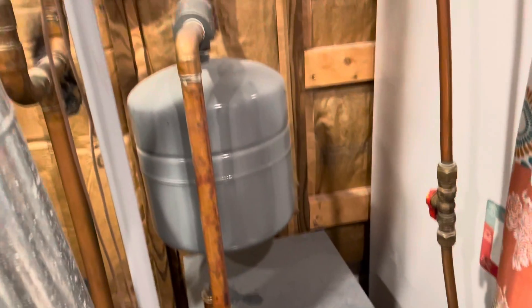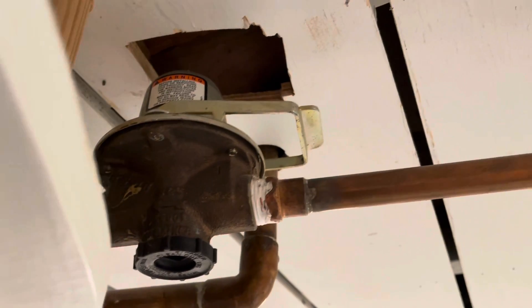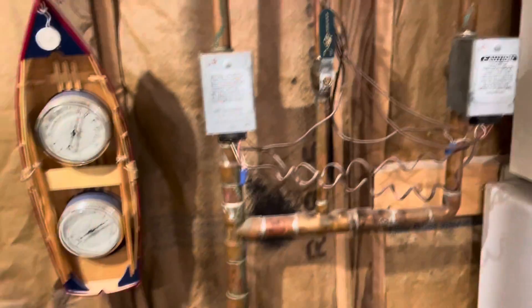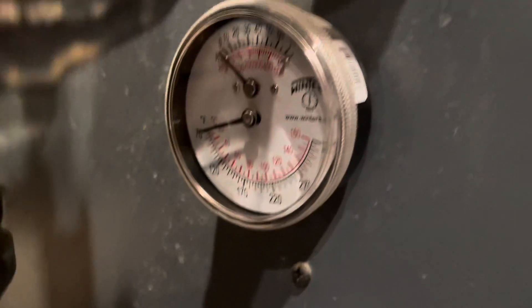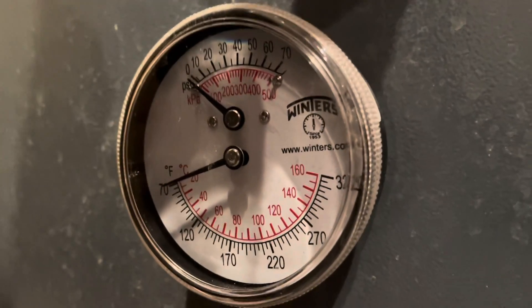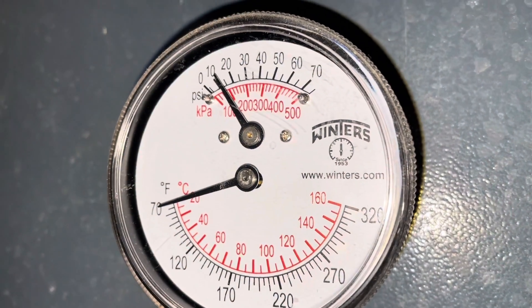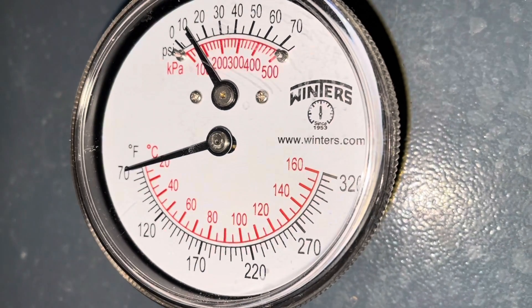The new valve sat overnight, so I'm going to go ahead and open up the valves to repressurize the boiler. I'll start by opening up my makeup water valve up top — there's a regulator here that should add only up to 12 psi, and that line comes into the main line with another valve. I'll let this fill up for a while, then open up the two valves on the pump side of the boiler once we get up to pressure. All I do now is watch this gauge — it should top out at about 12 psi. My pressure is up above 10; that looks good to me. We're going to call this project done — I hope this video helps you out, thanks for watching.